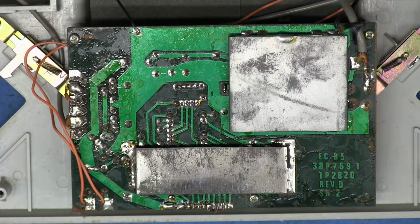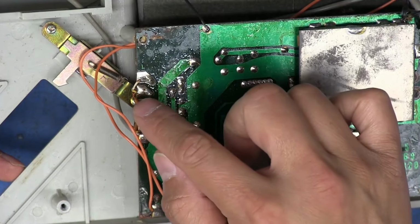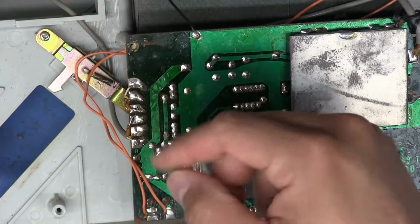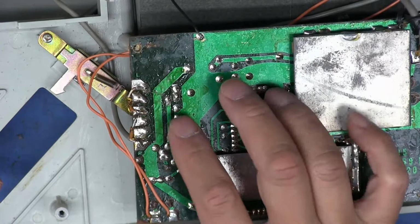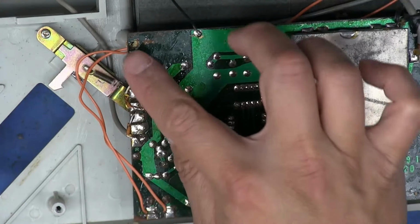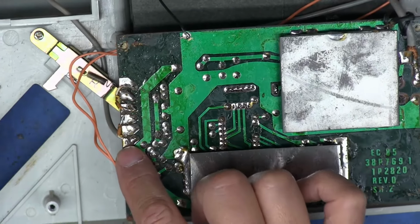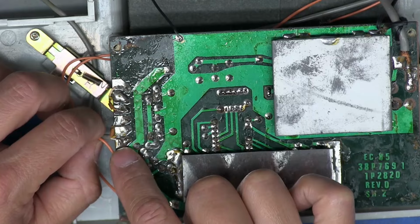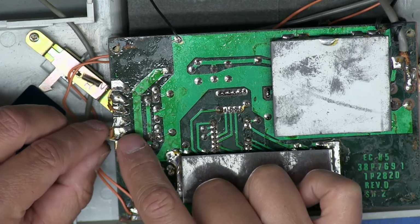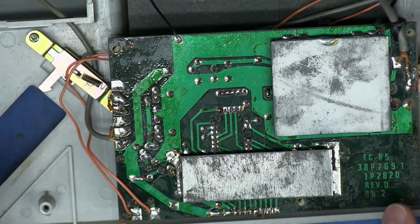We'll try to flip the board over and see what else is on there. Okay, so that's the 3 screws removed. Oh, and before I flip it over, on the side we can see that that's where the wires for the controllers go. So it's only 2 conductors, so they're just going to be basically linear pots that adjust whatever resistance, from full to nothing. And then we've got L, so that's going to be the left one. That's R. And it looks like they've actually got, oh no, I'm wrong. It's 3 conductors. Okay, so one's going to be ground most likely. The other one's going to be the positive voltage. And then the other one's going to be the center wiper of the pot. So yeah, I guess that makes some sense.